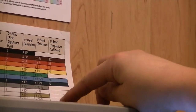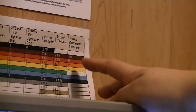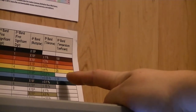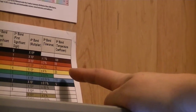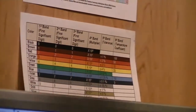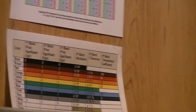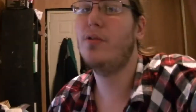Occasionally those colors are used — for example, green can sometimes mean 15 parts per million, and gray, white, and gold can mean 2 or 1 parts per million. But the most common you'll see are 100, 50, 25, 15, 10, and 5. Green can actually mean 20, I think, because 15 is orange. Those numbers don't actually equate to the usual digit numbers, which can be kind of confusing — that's why you need a chart. But that's another way to figure out which end to read from: if you see a band that's a color not usually used for tolerance, you can usually tell that'll be the other end of the resistor.